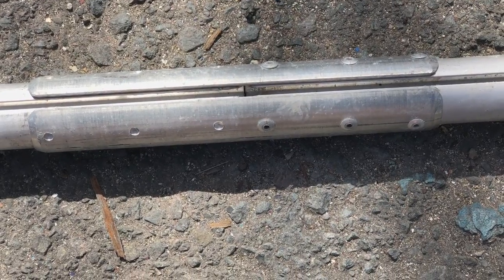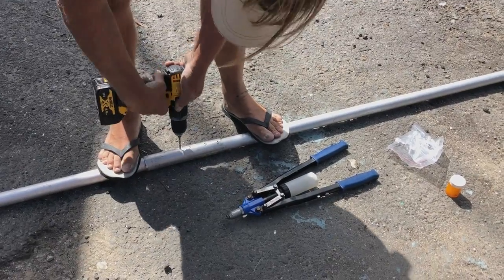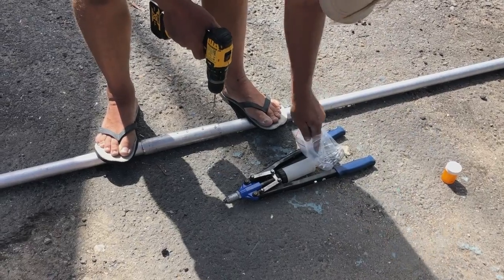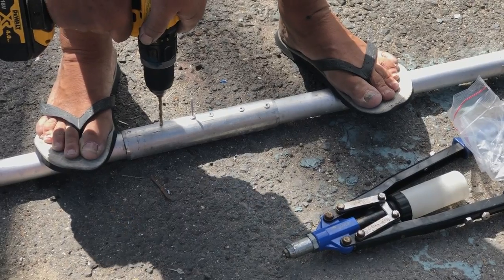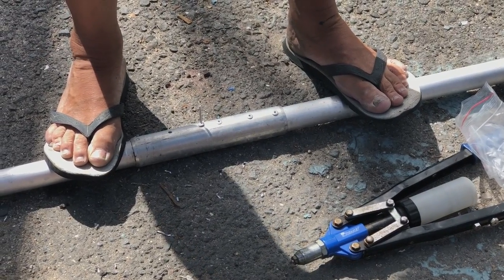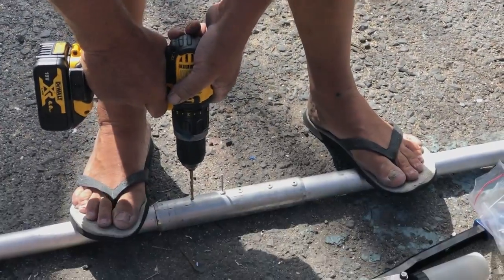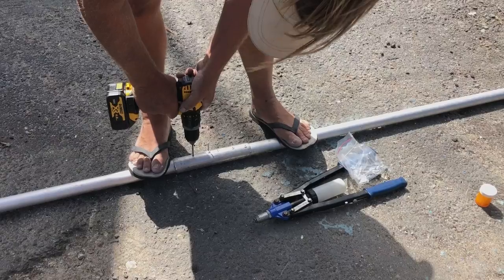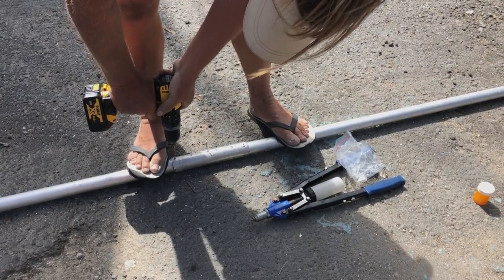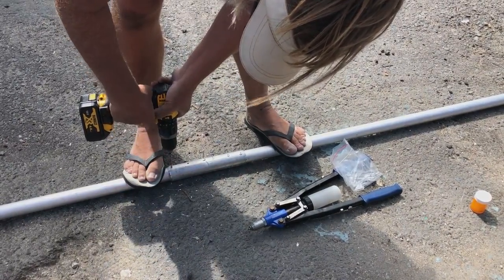Put the lid on my lube to keep the grit out, because there's nothing worse than grit in your lube. As you can see, I got my Japanese safety boots on. So, all safe. Because you're drilling into an area that's got a radiused section, the drill does bind up pretty quick. So it's gonna be gentle. Here we go. I was doing this once, drilling like this, and the drill put a lot of weight on it, the drill snapped and went straight in my foot.